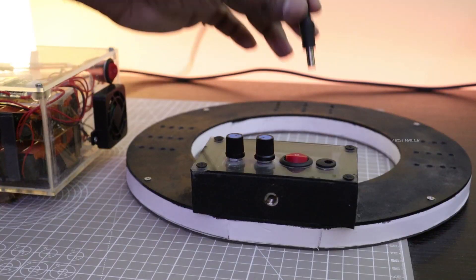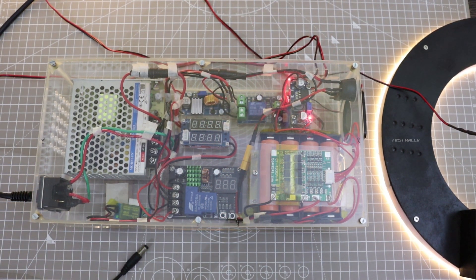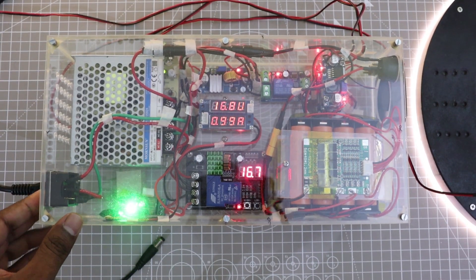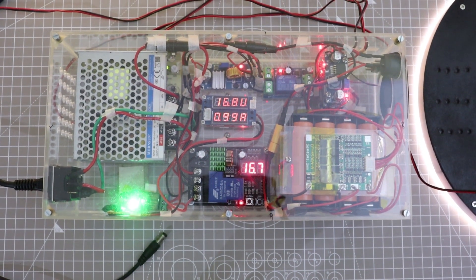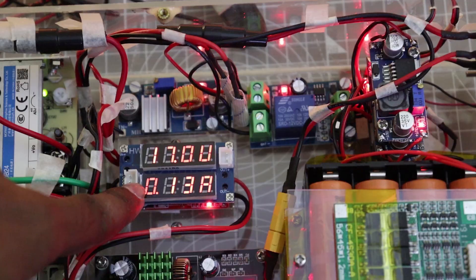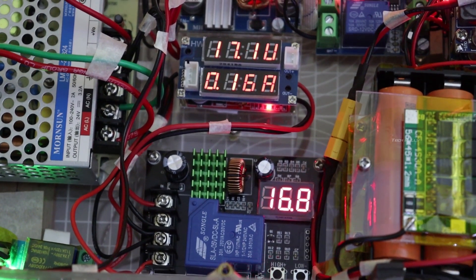I am going to use my DIY LED ring light for initial testing with 12V and 2A load. I turned off the main power supply and it automatically switched to battery power. Problem 1: while switching there was a 15ms delay which will make your router restart. When I turned the main power back on, there was no delay. I turned on the main power after draining the battery to 50% and the battery started charging. Problem 2: when power goes off while the battery is charging, there was a reverse current flow from the battery to other components — this happens only when power goes off during charging. Problem 3: when the battery is fully charged, the charging module relay should disconnect the charging process, but instead it got stuck in a loop, rapidly tripping the relay continuously. This happens because of the reverse current flow.